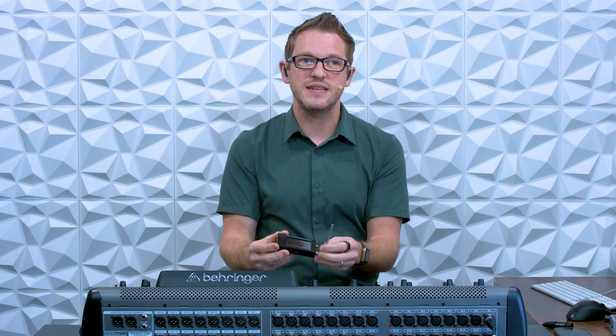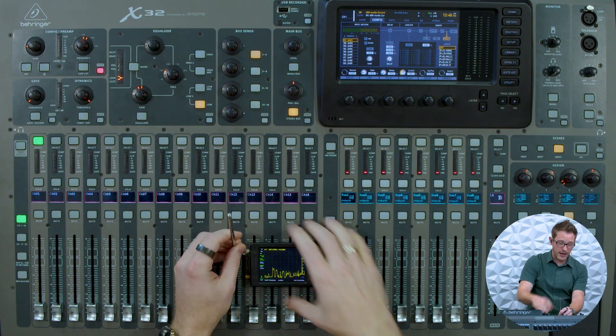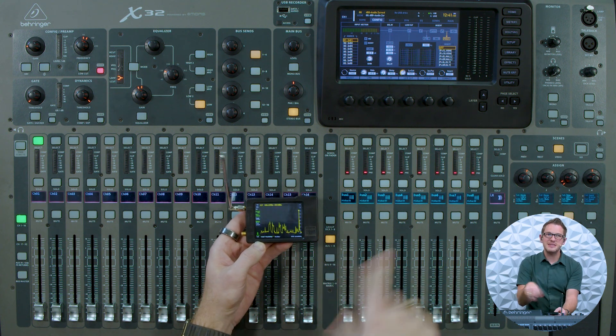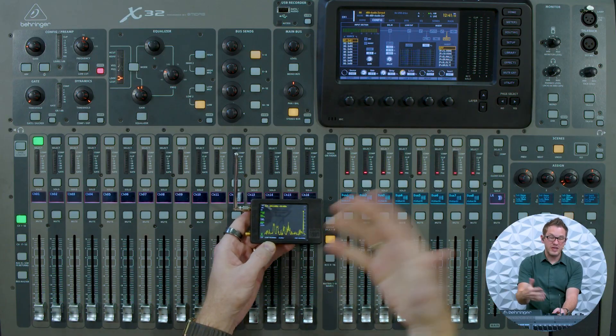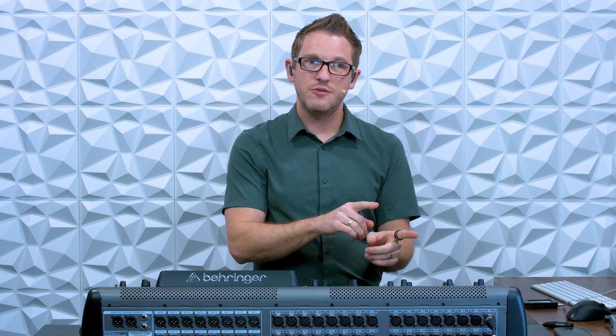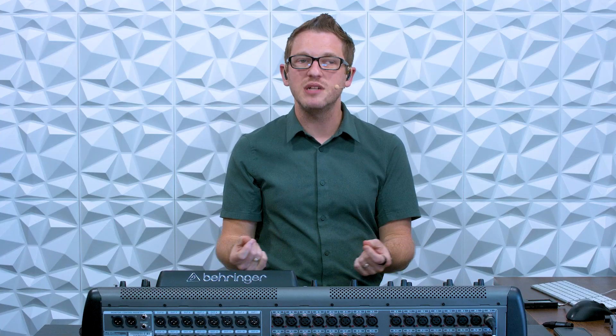The RF Explorer is another one, and RTL-SDRs is another one — there is a bunch of free software out there for pulling in scans off of these different devices. This spectrum analyzer can scan our wireless band and see where there are TV channels. Right here is a TV channel, and right here is also a TV channel. These TV channels are higher power than our wireless mics, so our wireless mics need to make sure that they are not sitting on top of a TV channel to work correctly. We can scan with this device and then load it into a tool like SoundBase, which is going to allow you to input all of your wireless devices and give you frequencies to actually assign to them so that all of your wireless frequencies will work correctly with each other.